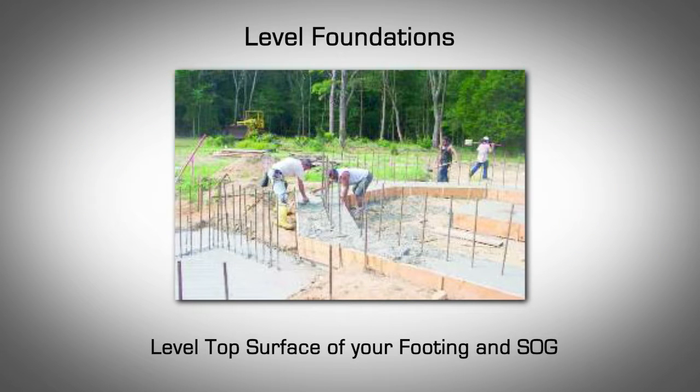Level Foundations: After pouring the footings or slab on grade, make sure the top finished surface is leveled to within one quarter of an inch. Commonly, this is the local building code requirement. A proper level footing will make installing the first two courses of block significantly easier. Level can be checked using a laser, transit, or water level. If you find that you're within the one quarter of an inch all the way around, proceed with stacking. If not, mark the variance of each corner on the footing or slab and adjust the ICF in later stages of installation.